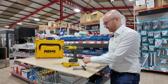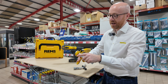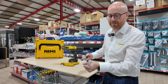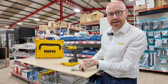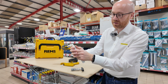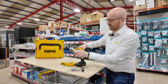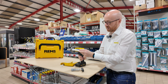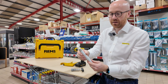To make a connection with MLCP, all you need is a press gun, pipe cutters and a deburrer. You simply cut the pipe. You may need to re-round the pipe after cutting — this re-rounds the pipe and also takes a chamfer off the edge which allows the fitting to slide straight on. You quickly check to see if the pipe has been inserted to the correct depth using the inspection window, and once you're happy it's inserted correctly, pop it onto the press gun and there you go — a bulletproof joint that's not going to fail.